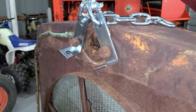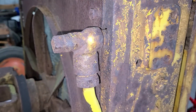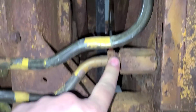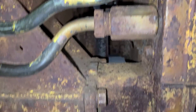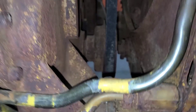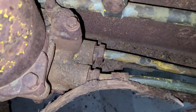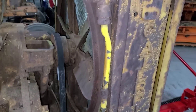With the radiator supported off these top bolts here, we'll start by removing this top oil line — see if we can get this fitting apart. And then on the bottom, we'll try and pull that fitting there. I already went around and made sure I can get them loose, and all of them did break loose on both sides. The main thing is these oil lines, if we can get them to come loose. Otherwise, we can try it back here.